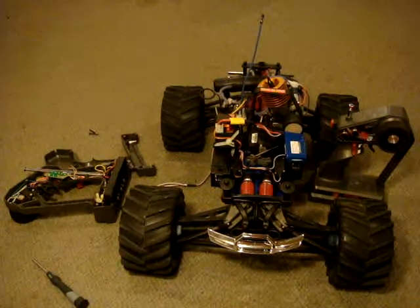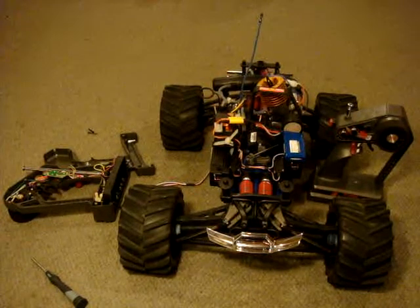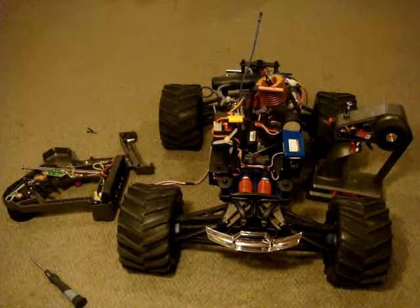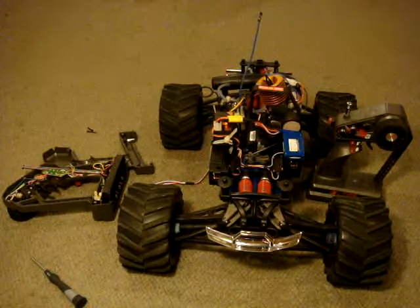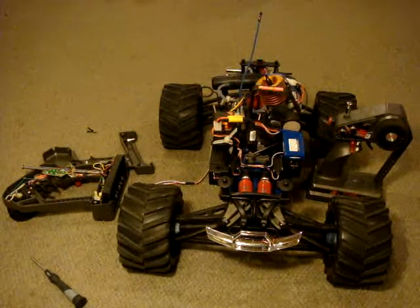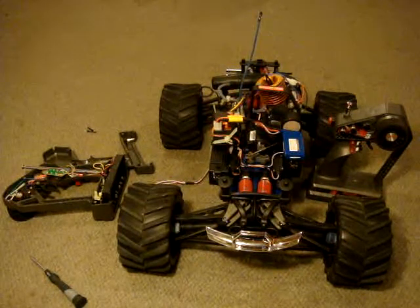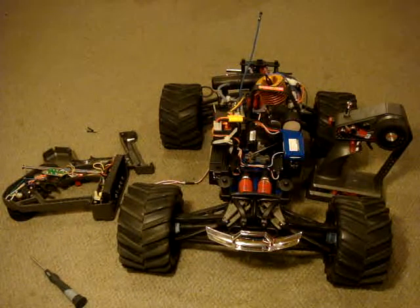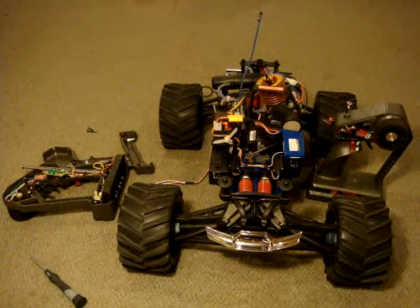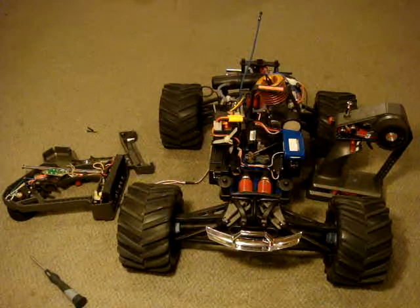Hi and welcome back YouTubers. If you were tuned into my last video you would have seen me demonstrating remote start and remote stop on my Traxxas Revo using a traditional TQ three channel transmitter. All I did is add a momentary switch to the transmitter to make this all possible. In my Revo I've got a forward only transmission which has been put in, so this basically frees up the forward and reverse toggle switch for me to be able to do this.